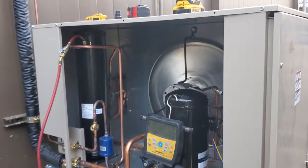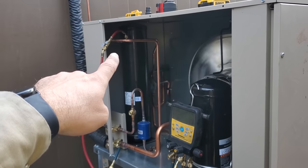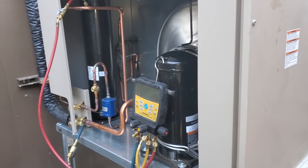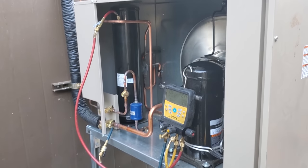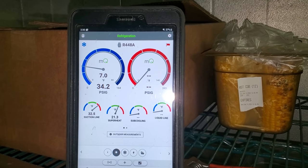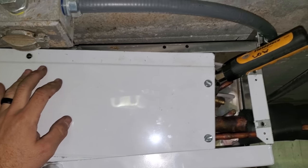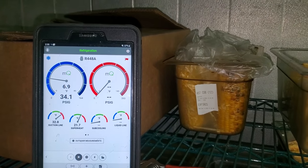The condensing unit's running nice and good. We're all charged up. The maximum refrigerant charge as per the factory was 20 pounds. It is R448A. So the system is actually down to temperature. I'm going to go inside and check the superheat right now and get that dialed in. Then we'll mark the liquid level. It's a little concerning how high the superheat is — 21 degrees superheat. Usually you don't have to adjust these valves very much. So I'm going to make some superheat adjustments on the expansion valve.